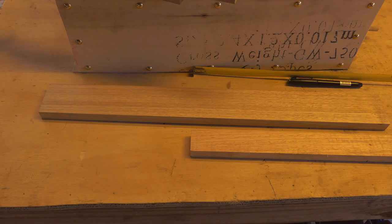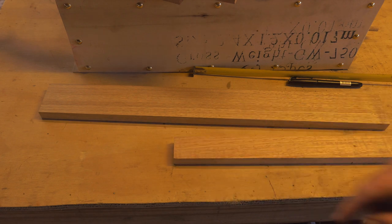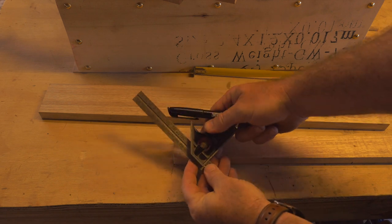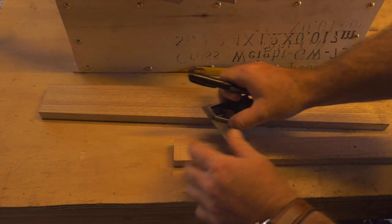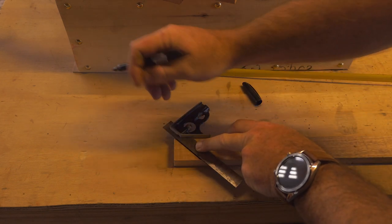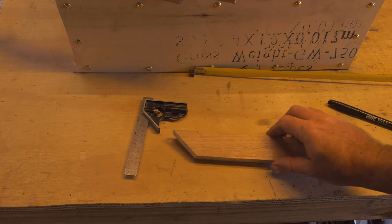Now we're going to make our next cut, which will be giving a 45-degree angle to the tip of our timber. We're going to work on the large guitar neck now. I'm going to use my square — at the very end there's a 45-degree angle setting. You adjust a little nut and slide the rule, tighten it up, and then use that to make a perfect 45-degree angle line. This is mainly just to make it look prettier instead of being totally square. I'm going to cut that piece off and there it is, all done.